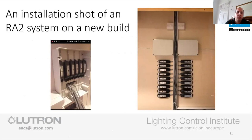The next one is, on the retrofit side of things, we're talking about fitting things in ceiling voids, etc., dropping GU10 lights out and putting the inline dimmer up there and then putting the GU10 back. We talked about pendants, for example. You can take a pendant down and maybe drill a round Euro fast fix box up. That gives you enough aperture to get the inline dimmer up, do your connections, and then fit the pendant back to the fast fix box.